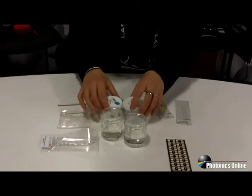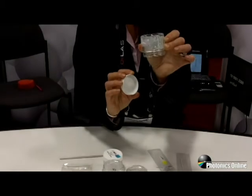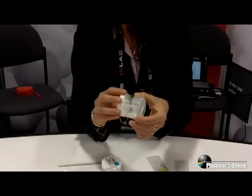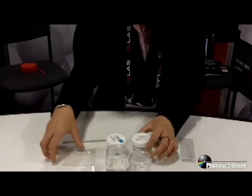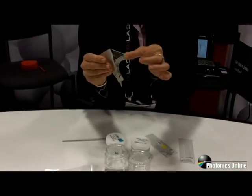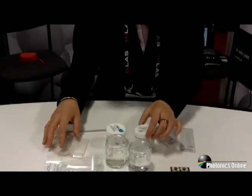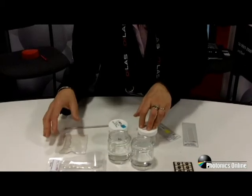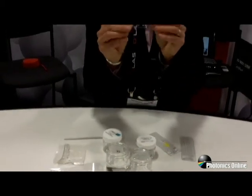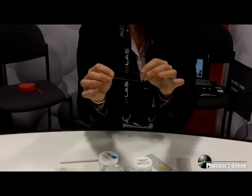Silicone elastomers can also come in a variety of different viscosities. This is a silicone LSR designed for liquid injection molding — it's also clear. There's also a silicone that can be made clear for extrusion for making tubing. The trade-off is these thicker silicones have a little bit lower optical transmission, whereas something like LS8941 is very clear, though it's a little stiffer than some of the other materials.